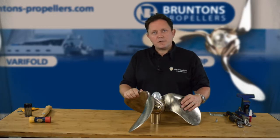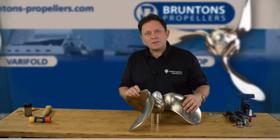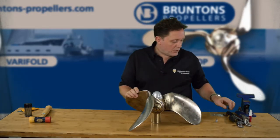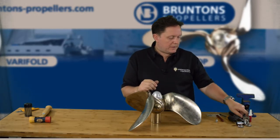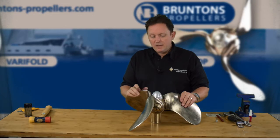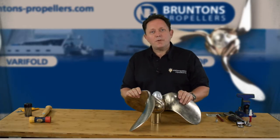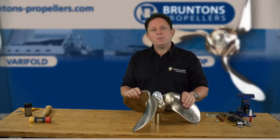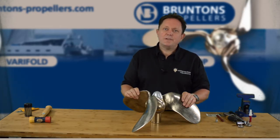As you can see, it's a very, very straightforward process. On camera it's looked a little cumbersome at times, and I'm sure in the yard it would also be a little cumbersome. It's all about having the right tools and just knowing how to hold the propeller and having the torque wrenches. Most of these little tools you can probably make yourself. The nut spanner was quite crucial, but I think the most crucial was having a little torque wrench just to set the blades and to make sure they fell. Thank you for watching. If you enjoyed this video, please feel free to click on the subscribe link. We post regular tips and tricks on maintaining your AutoProp, your VariFold, or your Sigma Drive — three products from Brunton's Propellers which we sell. Thanks very much and see you around.